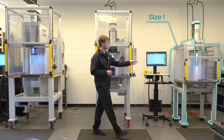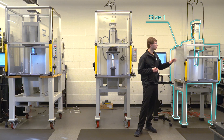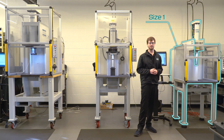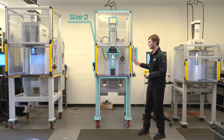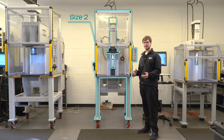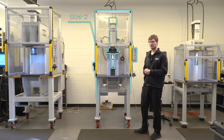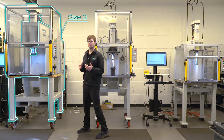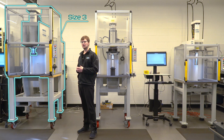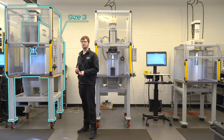Starting with the size 1 all the way to the right, this is capable of holding ranges from 1 kN to 12 kN. Right now we have a 12 kN EMAP loaded into the station. In the middle, this is a size 2 C-frame capable of holding forces from 20 to 30 kN, and we currently have the 30 kN loaded into the station. Moving all the way to the left, we have our size 3 C-frame workstation, currently with 120 kN, and this system is capable of holding ranges from 40 to 120 kN.